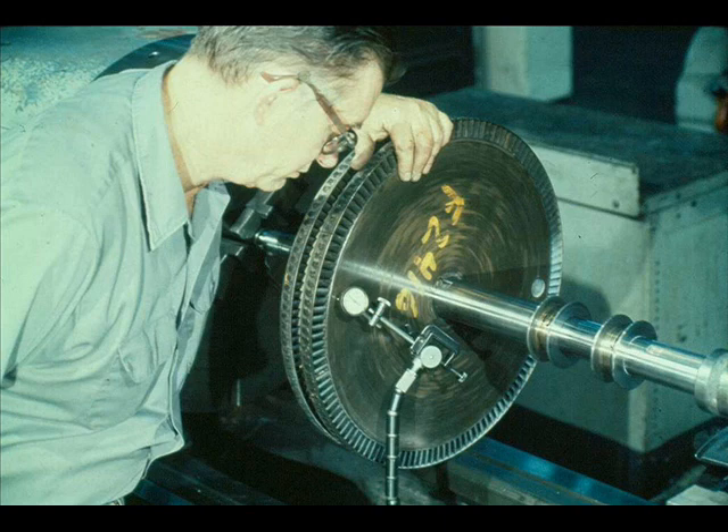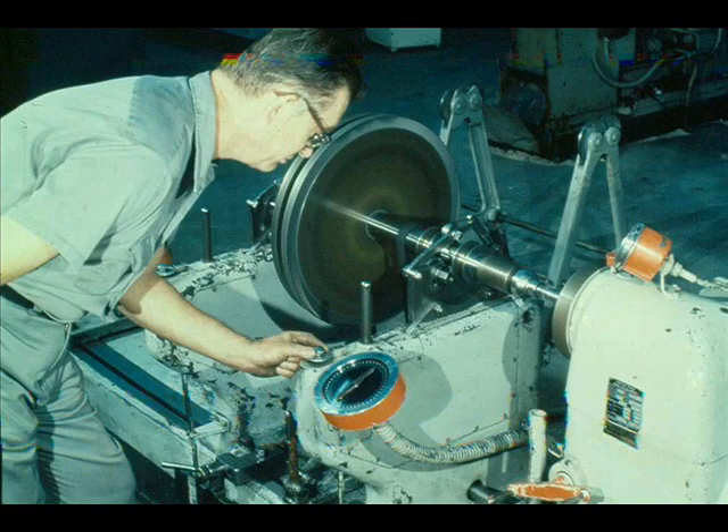The final indicator check to be made is of the face of the rotors — check both of them for run-out. The last step also has to do with the rotor assembly: it must be checked for dynamic balance, as the workman is now doing. Your instructor will explain this procedure as it is now used at your plant.